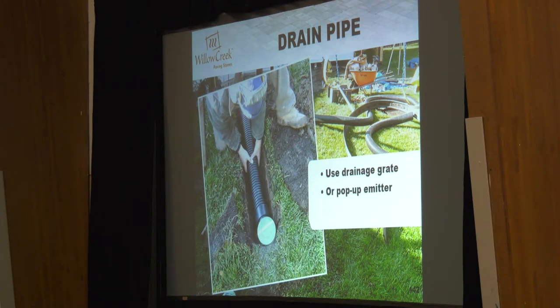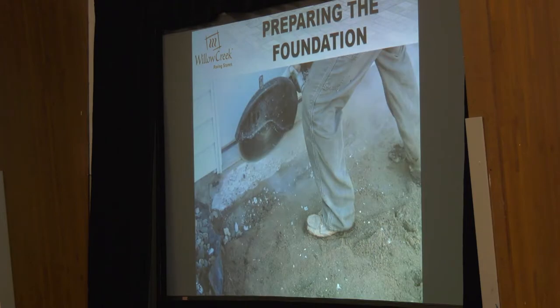In this case they had to break off a landing — there's probably some rebar coming through there. You do have to cut that down at the top where your pavers are going to sit because you don't want that to affect your pattern. With new guys, every year I end up with one or two fresh fish on my job site, and if you leave them alone when you're making cuts, you come back and find some pretty abstract stuff. I've seen guys cut the soldier course or sailor course to accommodate curves. Don't cut your border pavers to fit around crappy concrete — cut the crappy concrete out of the way and then your pavers are clean and perfect.